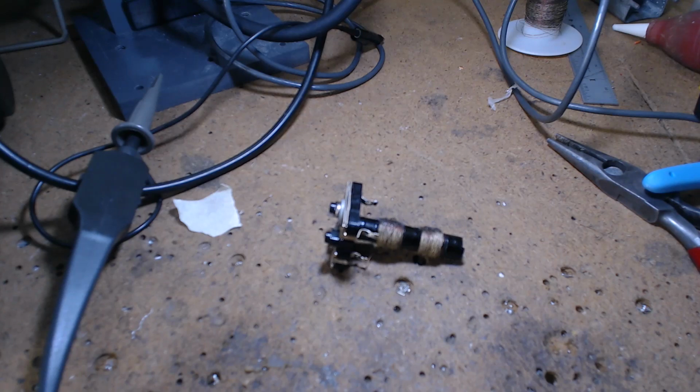But I'll work on it a little bit each day. You know, like yesterday I got the coils wound. Today I'll add the wires on, double check that I have continuity, put it in there, let the wires hang, because that's the final part of the radio, is the fourth IF. I still have to, I won't recap right away, but in other words, I have to build a power supply for it. I have the parts. I won't recap. But the next step is the filament has been bodged for 6 volts.